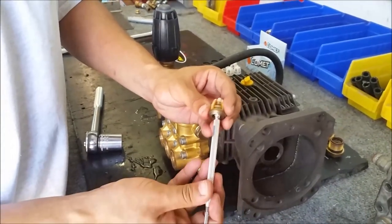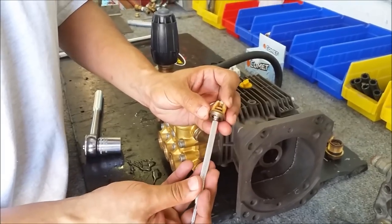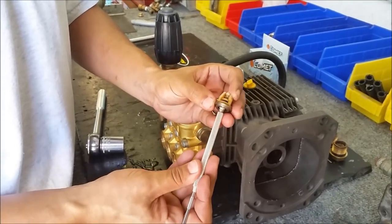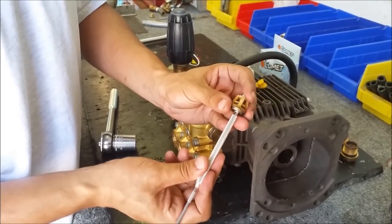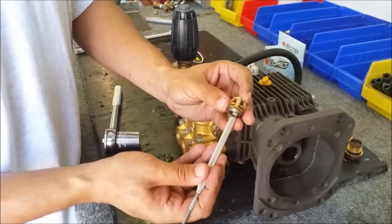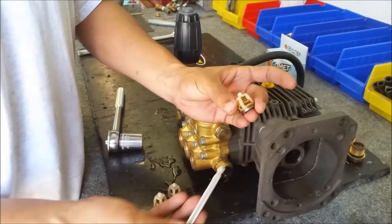There's no debris here, but you could easily find lizard skeletons, pebbles, pieces of cloth — really anything that can get pulled up through your water supply. A lot of times you're going to find it here inside of these valves, and I just like to check that they open and close and reseat well.